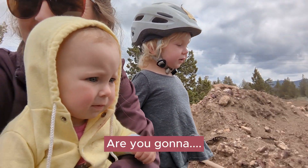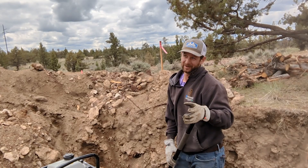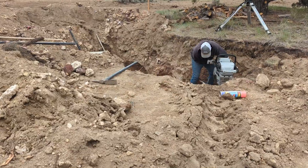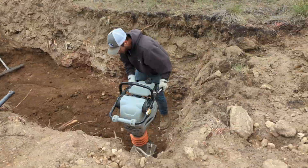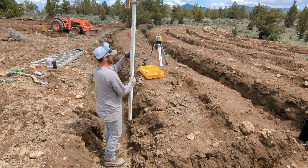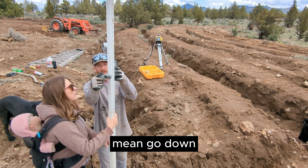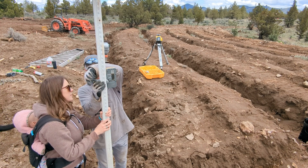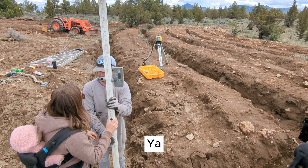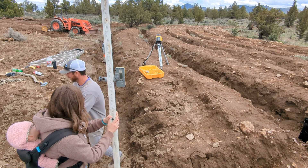Daddy? Yeah. Is that really loud? Yeah, louder than you outside, not inside. Okay, so this is our grade — fast beeps mean go down, slow beeps mean go up. 5.38 was our number from this morning. An even beat means we're doing something right — see that constant beat? That's perfect. Perfect, perfect, okay.